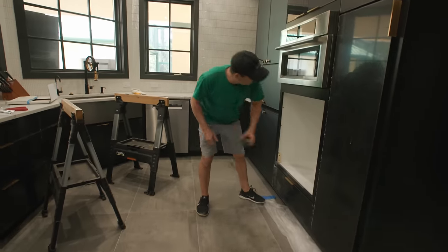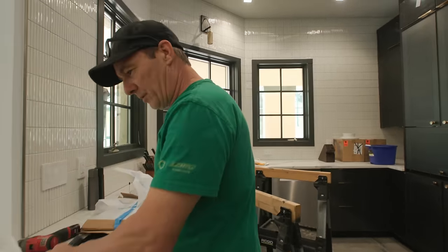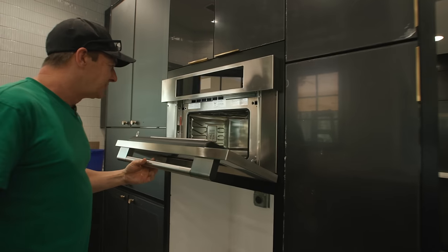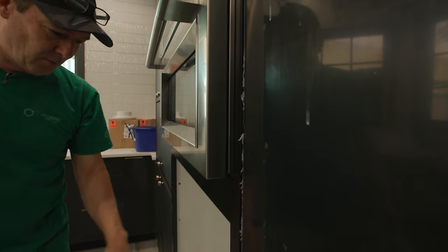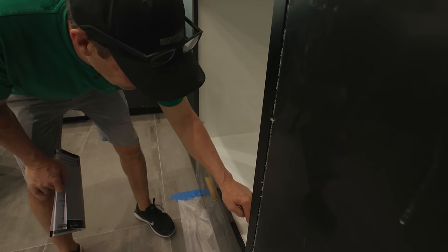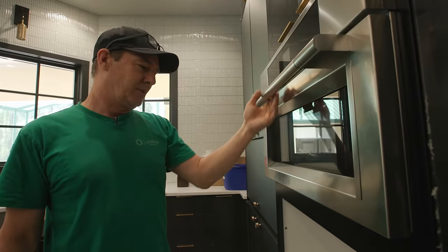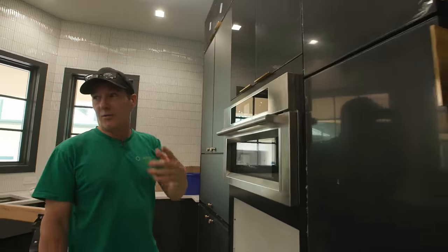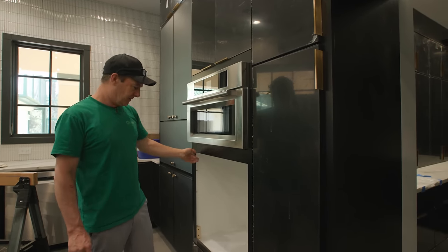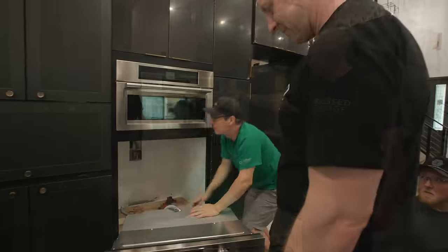So now all that's left is the oven. So I'm going to go grab the install instructions for the oven and see if it's a similar situation. The way this Foster Milano is, they don't want a protruding face frame. So they want the face frame flush with the box, so it sits on the box. So their opening is, they're thinking the box opening should be their finish opening. Well, that's not the way most cabinets are built. So what we did was we put a 3/4 inch piece of material in there. It was shelving material that was left over, so that everything was on the same plane as the outside of the face frame. So we might have to do that with the oven too. Oh, yeah. We're about done with this place.